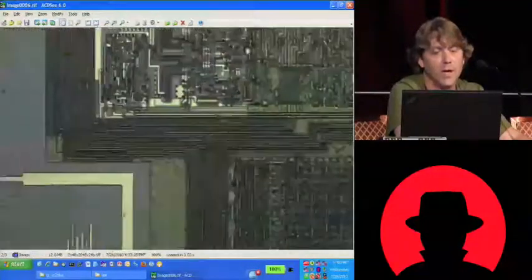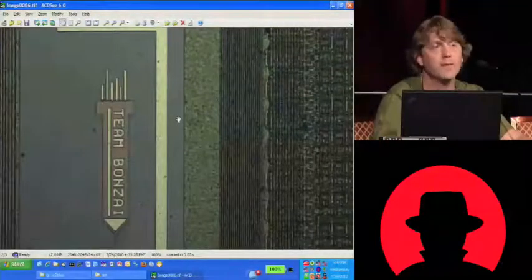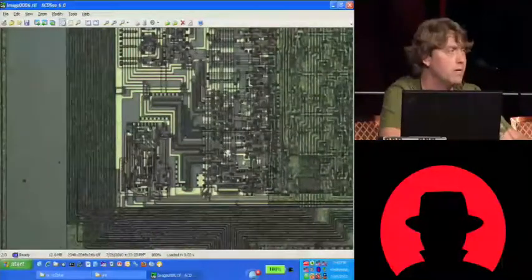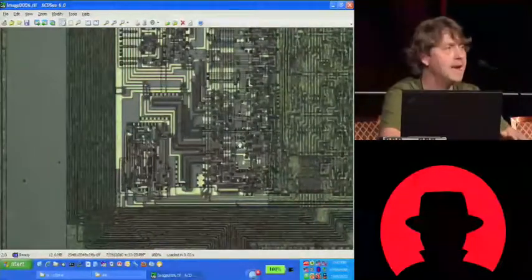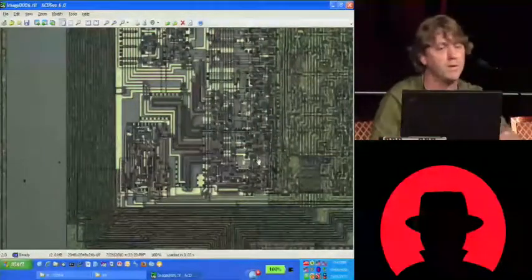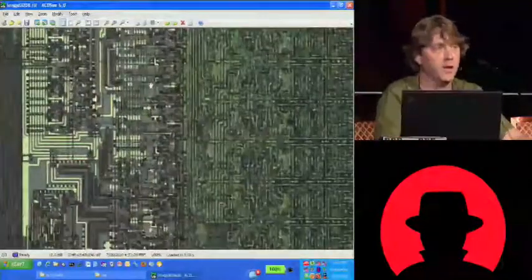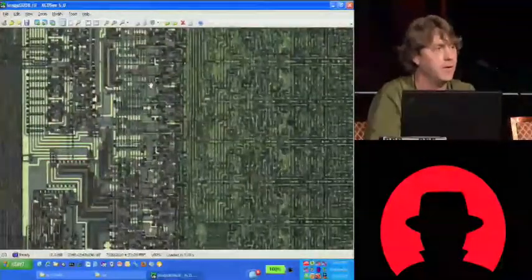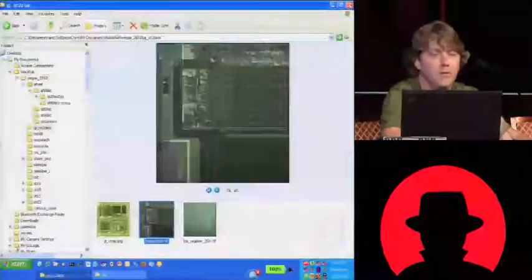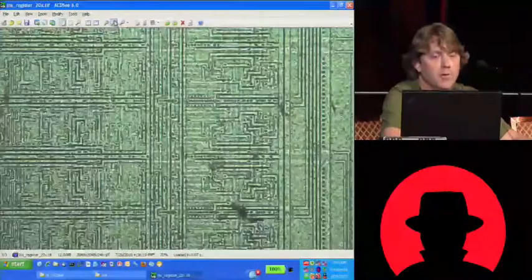But what's ironic here is I can tell that this is made by TI. This looks exactly like the older TI chips. You can tell the footprint, the way the process is laid, who makes the chip. Like I can spot TSMC any day, any time on the 250 nanometer process and the 350 nanometer process. And it's interesting because once I study their flash on one, it's the same on the others that use that same type of flash. Maybe it's 16 bits though instead of 8 bits. It just depends.